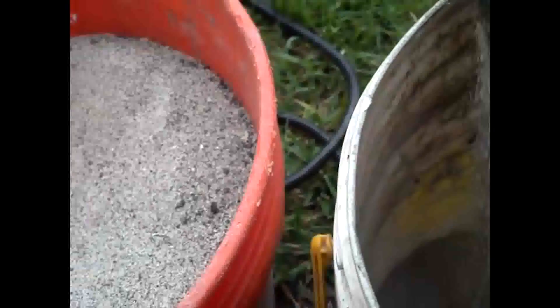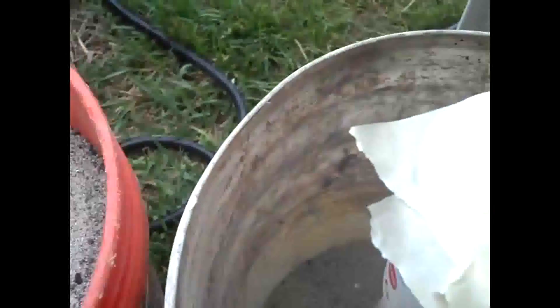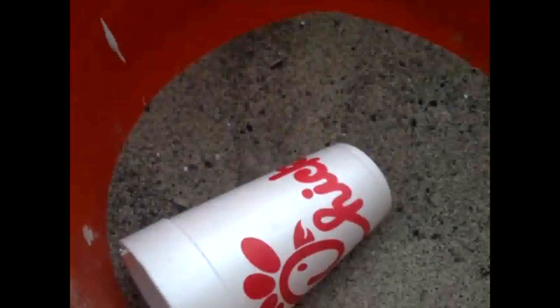As you can see, this is dry sand. I use what's at hand — whatever works. When there are undercuts, you can push the sand down to make sure it fills in. You can also tap on the sides to get the sand to fill better. I leave the masking tape on until right before I pour, then tear it off and go — and if there's any sand in the cup, it's easy to blow out with an air hose. Okay, ready to pour, ready to smelt some metal.